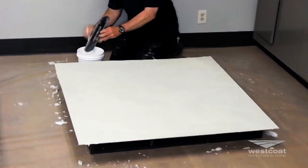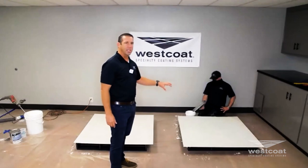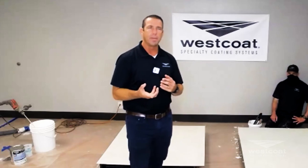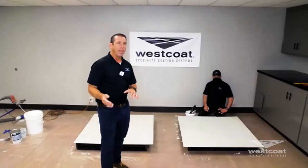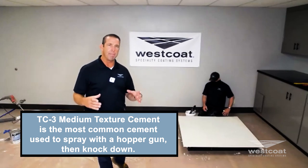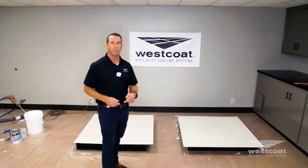I always tell people: you really need to be consistent — consistency gets you paid. There are a lot of different ways to apply texture. I mentioned the knockdown texture hopper gun — you can skip the knockdown and just spray texture, or use a smaller hole and higher pressure for a finer texture. Contractors that like spray texture use our TC2 cement. TC3 cement — which we're not showing today — is the most common cement for spraying texture through a hopper gun and then knocking it down. The skip trowel texture is on our custom finish specification.